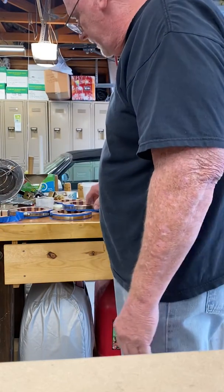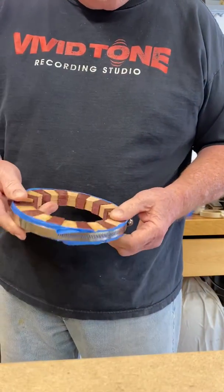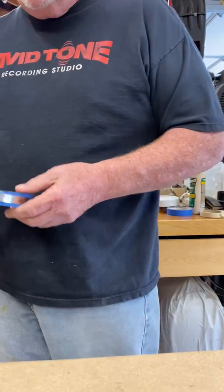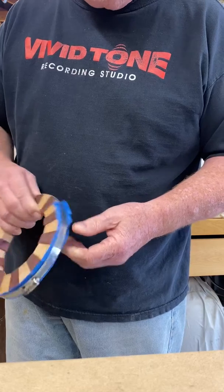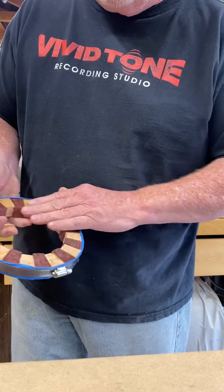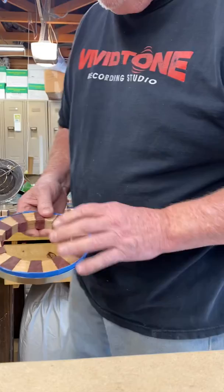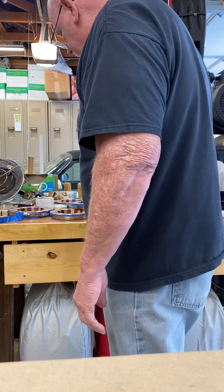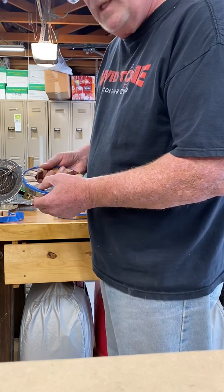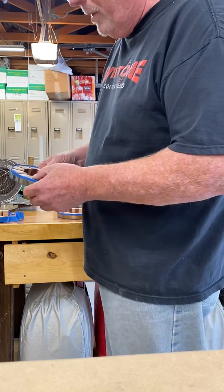What I wind up doing is I cut all the pieces I need with this wedgie sled, thanks to Jerry Bennett and Tom for their instructions. I glue it up, put it in a ring. It's very rough right here. And so once these dry, I can run them through the drum sander and then they'll be pretty good. So I don't have to do any extra sanding by hand for the joints. It comes out with the wedgie sled perfect, and I've had yet to have any come apart, show gaps or anything.